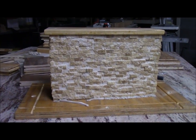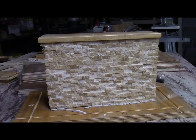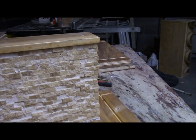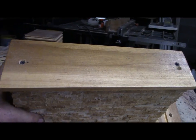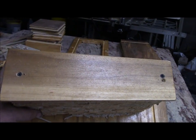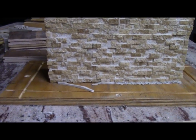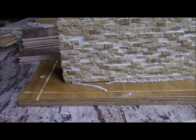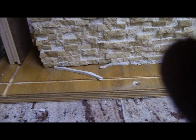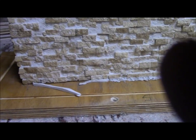I'll try to provide some pictures of what it looks like finished. This is a pattern for one of the pillars - this happens to be one that goes with three pillars per each 30-inch section. You can see this is pie-shaped, because this one is for the curved section. The method I use, I call it a spline method for the molds. In order to put the sections together, you can see I put a spline in there, both bottom and top, and that holds it together.